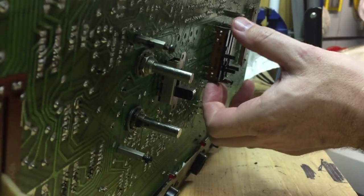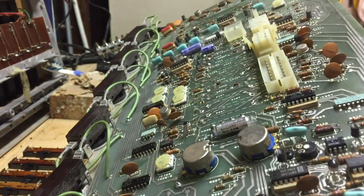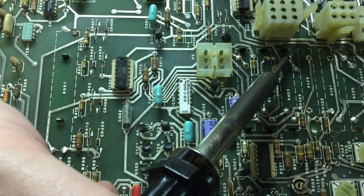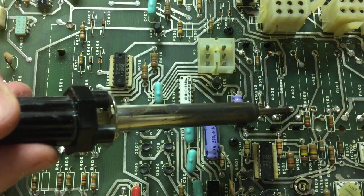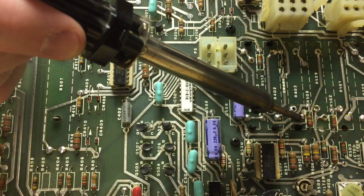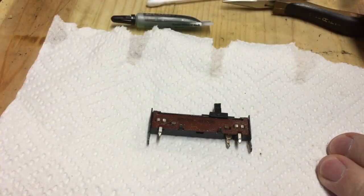The sliders are held on to the board at three solder points — two on the top, one on the bottom. You can desolder them conventionally, but I found it's pretty easy to keep some tension on the backside with your fingers, work on one solder point, and after you get that one open just go to the other two while keeping finger tension on the back the whole time. Get one undone, then the other, and the whole thing comes off like so.